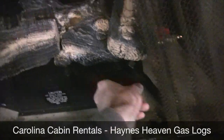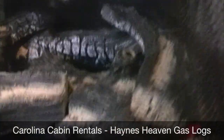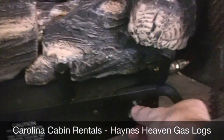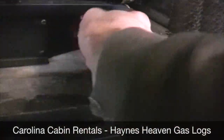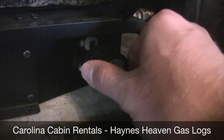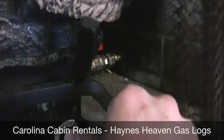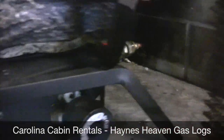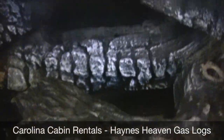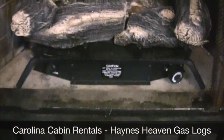But if you don't feel heat, then you'll have to light the pilot light. To do that, you want to turn this knob all the way clockwise until it clicks. Then you turn it counter-clockwise until you feel it click just a little bit. Then you push it in and you'll hear a little click, and then you can hear a hissing sound — that's the gas coming out of the pilot light.